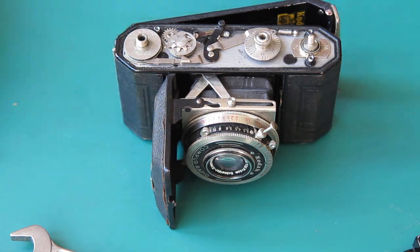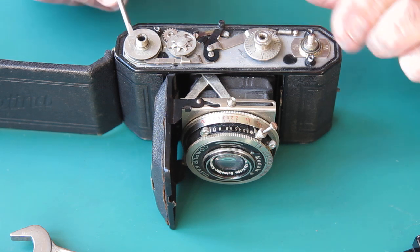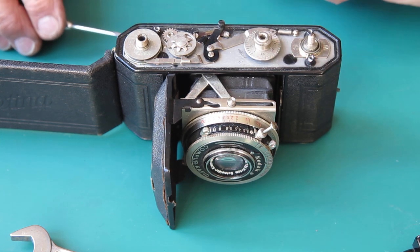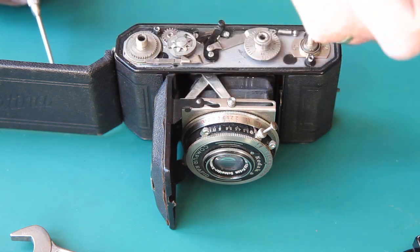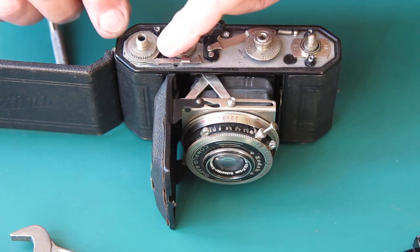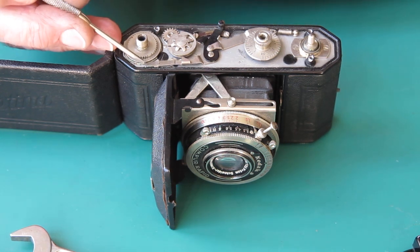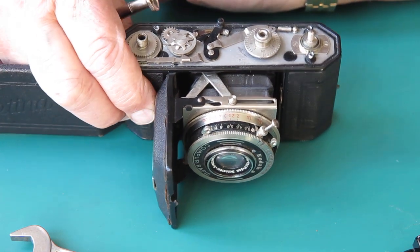And there's my film advance mechanism, such as it is. There's not an awful lot to it. This is all very clean. You can see there's a little bit of dust in here, but nothing to speak of. This should be an easy job. That little washer there has got a raised lip in the centre, that goes on the top. Here we've got a gear or ratchet pawl, and you can see the teeth are swept back. I see that the lever that engages with this — the tip on it — is somewhat mutilated.